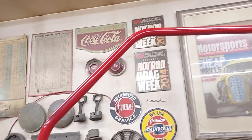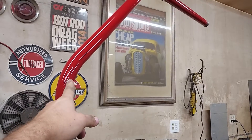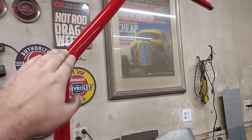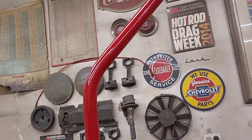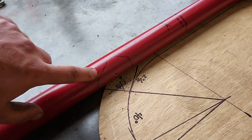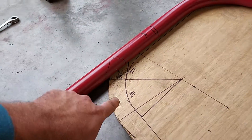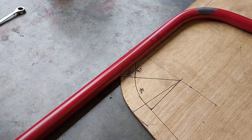For a lot of other YouTubers, the cage is kind of a last-minute thing — they always do the big horsepower and shooting fireballs first. Because it's a last-minute thing, a lot of times their cages don't get painted and they end up rusting, and then they have to go back and clean all the rust off. Before we install our bars into the cage, we actually like to paint them first. You may say, 'I still have to weld bars to this' — well, there's going to be an upper windshield bar that comes across, and all you need to do is sand a little bit off there and then you can weld the joint. Also, whenever two pipes join together we drill a tiny hole so that pressure doesn't build up inside the tube and have nowhere to go when you're welding it.